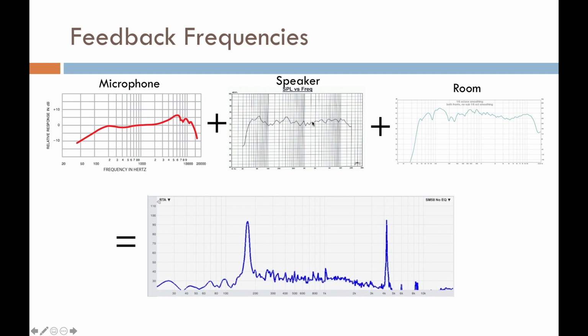And these two frequency responses will superimpose on top of each other so that maybe some dips in this range cancel out peaks in this range, but in some cases you might get peaks adding to peaks. Therefore, you might have much more gain at a certain group of frequencies than another group of frequencies by combining this microphone and this loudspeaker. But once again, we're not done.